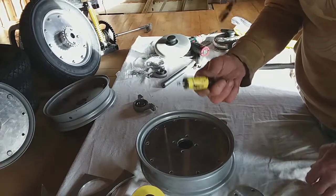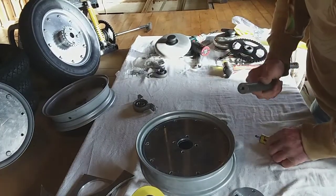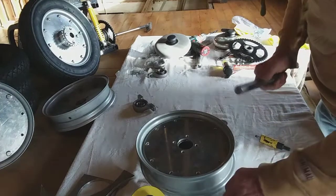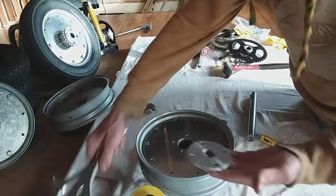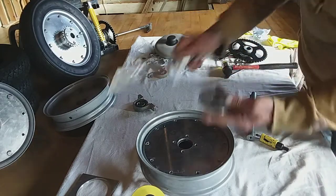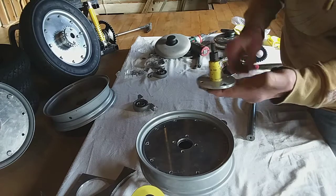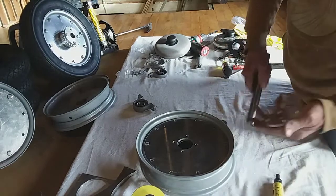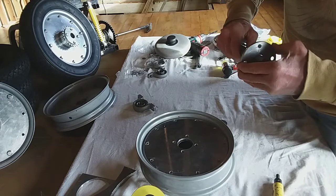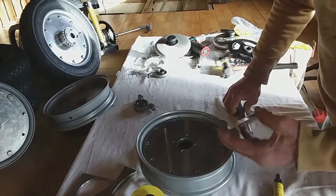Now the ones that want 25mm on the end that are going to go on the shaft - at the end of them - I've done the same thing. I've drilled them out, but instead of putting the inch and three quarter in the middle, I've just gone through with the 25mm one. So it goes on there like that, so the sprocket can't get away or move out of line or anything.